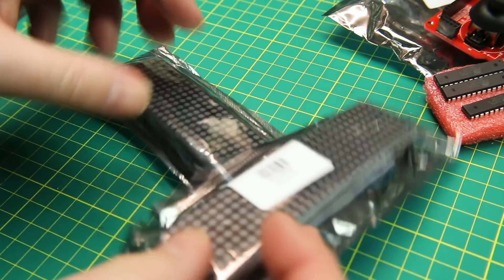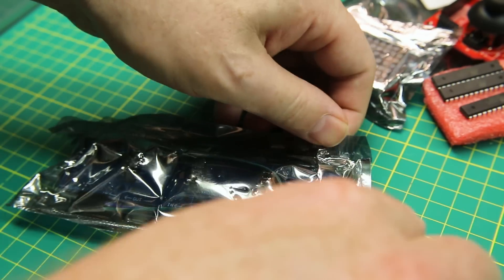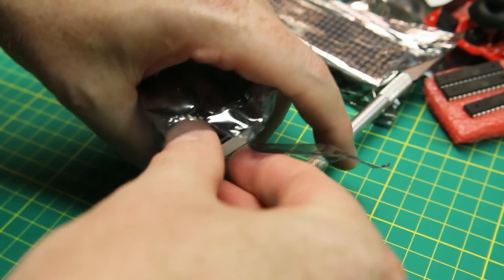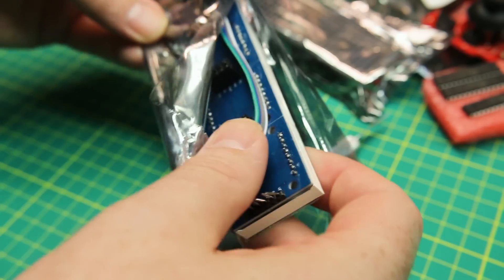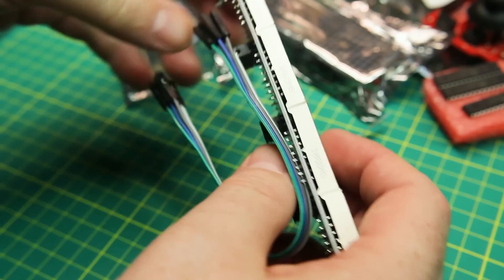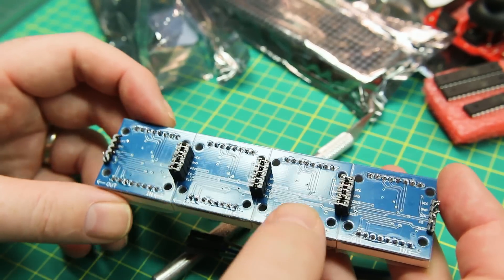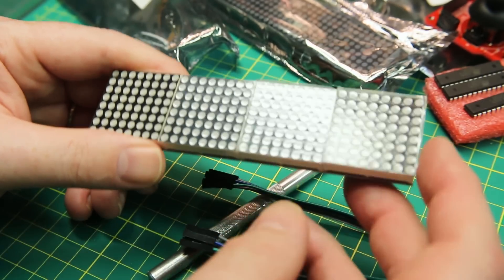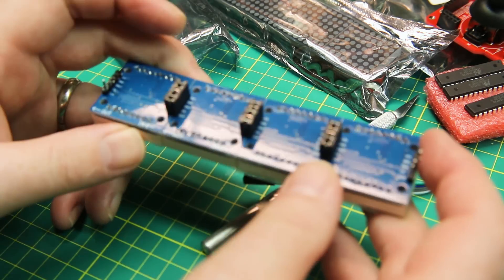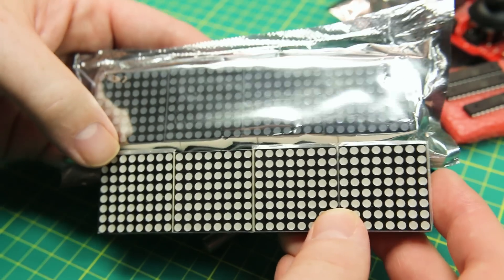Next up, we got some spare LED matrices. These are the ones I used for the YouTube subscriber counter with an ESP8266 and a scrolling text display. I don't use LED matrices very often, but they're a handy thing to have in your bin if you want something to display scrolling text and be very visible. One got some shipping damage — bent pins, no big deal. I think the chipset is the MAX7219 or something. You can find the link and sample code on my MKME GitHub. Got two of them — I might do another subscriber counter and have one on the bench.